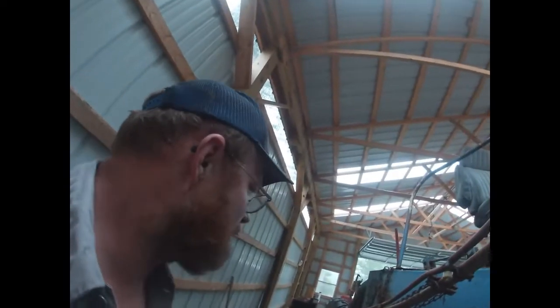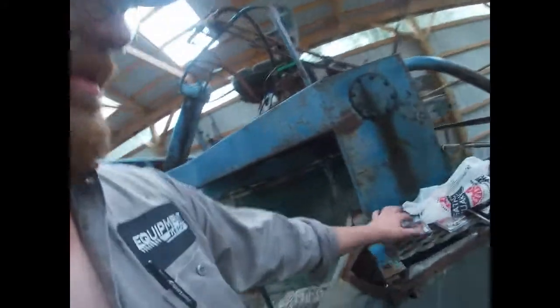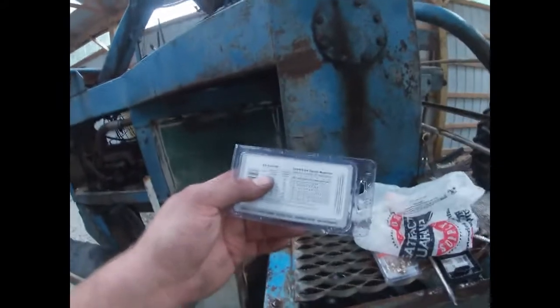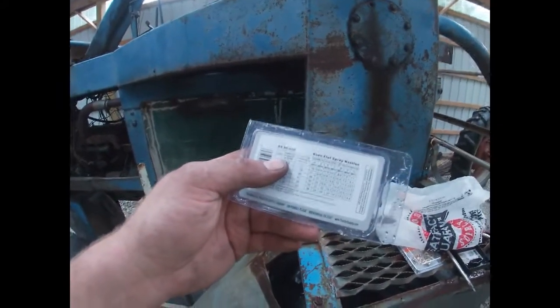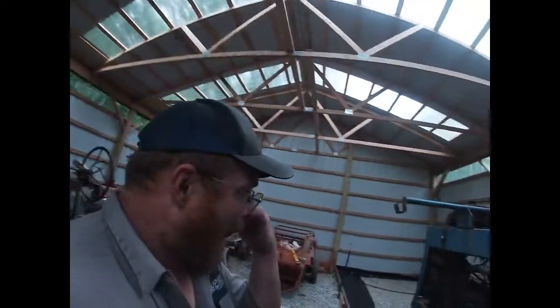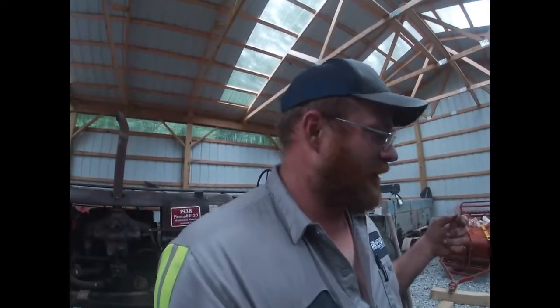All of these are pretty good. Like I said, we're going to change the nozzles over, but I'm going to have to look and see if I can find a lower-flow spray nozzle than what I have, because I don't think these are really going to be the ticket. I'll have to compare notes and see what I've got versus what's available, and figure out what I can do. Hopefully the other ones are cheaper too — these were like 16 bucks for four of them. We're going to have to find the lowest-flow nozzle we can get, and then probably a pressure regulator too.